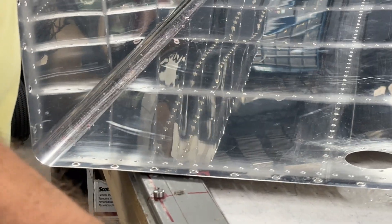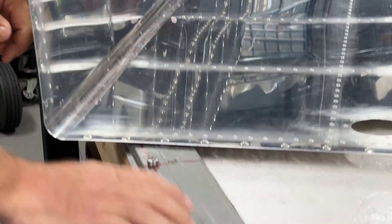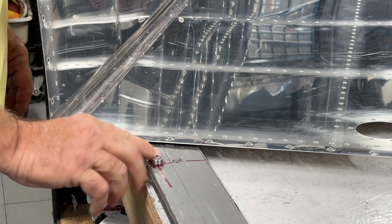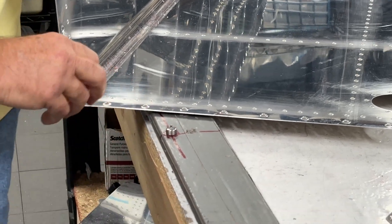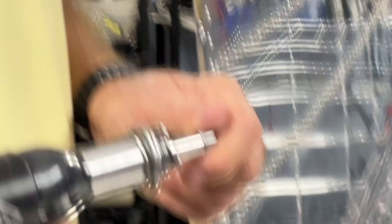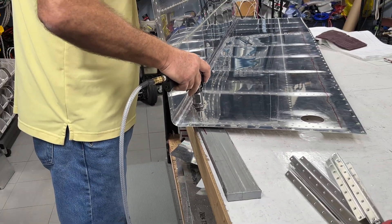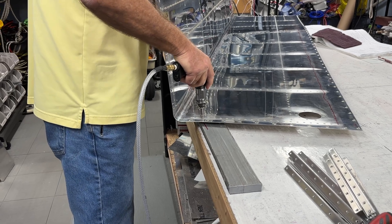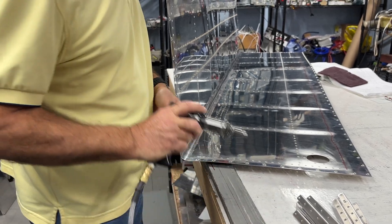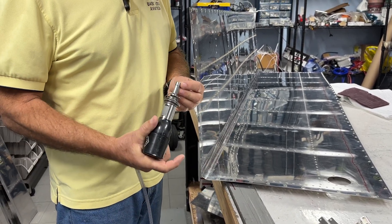One of the things I did that worked out really well: I had this big block of steel left over from when I built my RV4, 1980-something. I put the male die for the dimple in it and just move the skin across it. I basically couldn't pick up these last six holes. I set the gun on real low pressure so it was barely moving. You just hold it over top of the hole, squeeze the trigger, and it only takes a couple of hits and it mushes it down real nice.